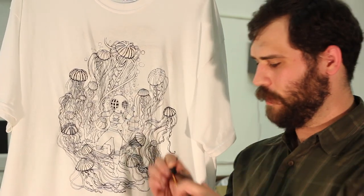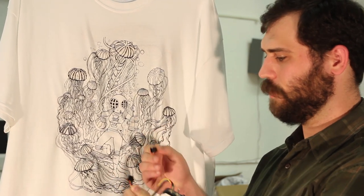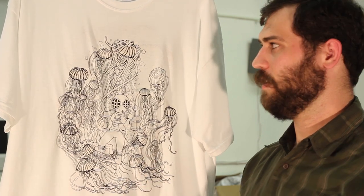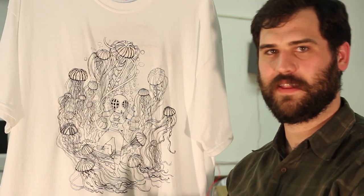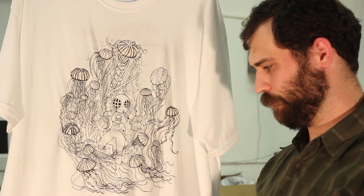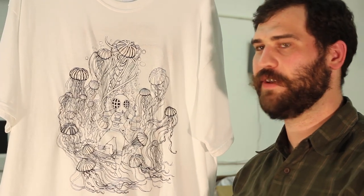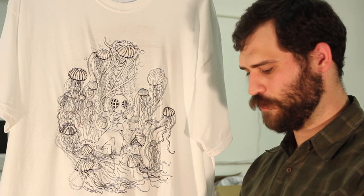Another little detail that we added was a disconnect connector. So the shirts and the electronics can be disconnected. In case there's a problem with the shirt, we can do troubleshooting and make sure it's not the controller or vice versa. Or if we wanted to have certain people stand in a certain order, we could just switch the controller rather than having to reprogram the IDs in the controller boxes.